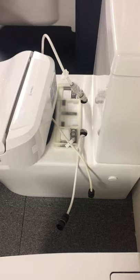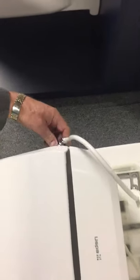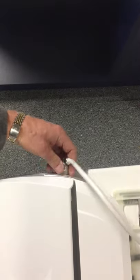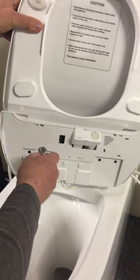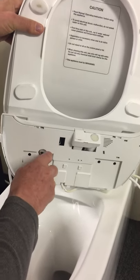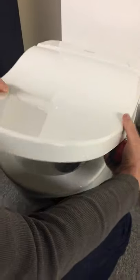But with the services integration kit, it's fairly simple. Now at the side, just undo the swivel nut, lift the toilet up, locate the drain plug, and turn that horizontally. You may need to ease it out a little bit.